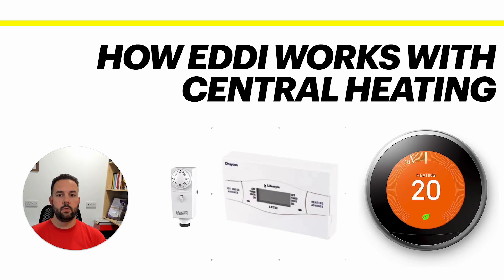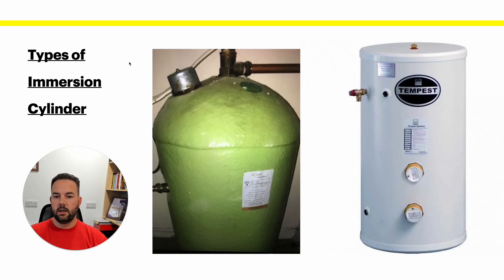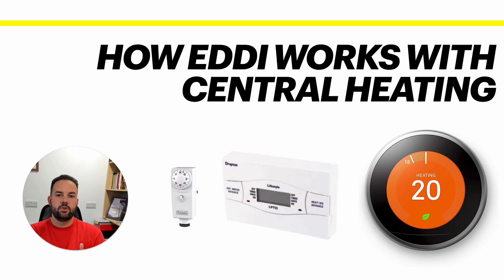There are two different ways you can use the Eddie alongside this. Number one: you can turn your gas off. All summer, when you don't need heating, you could just turn your boiler off or turn it down really low and just let the Eddie handle everything. The other way — which is more likely — is you want the Eddie to supplement your gas, or the gas to supplement your Eddie. You can make this work using your cylinder stat: set the temperature on the cylinder stat and the thermostat in the immersion element so that the Eddie heats the tank and the gas boiler doesn't come on once the electrics are up to temperature.